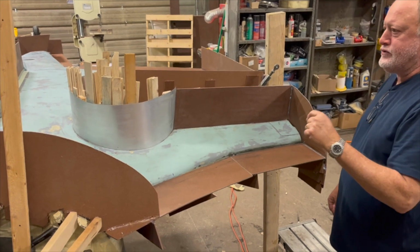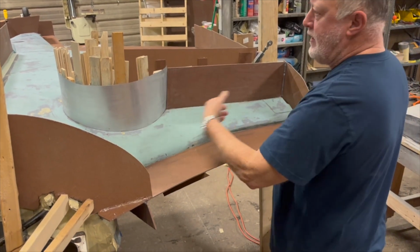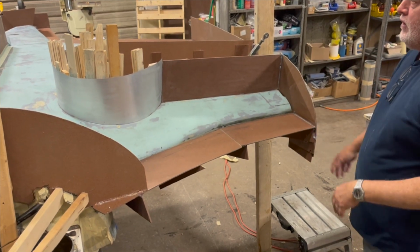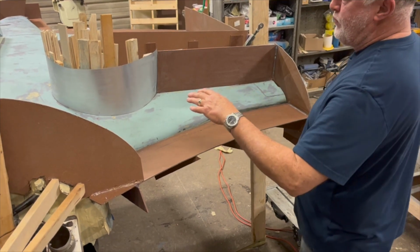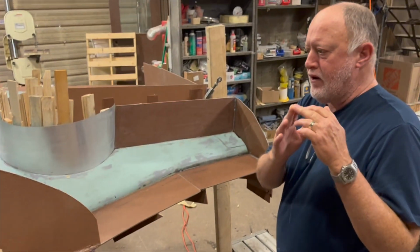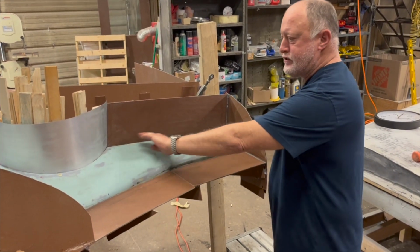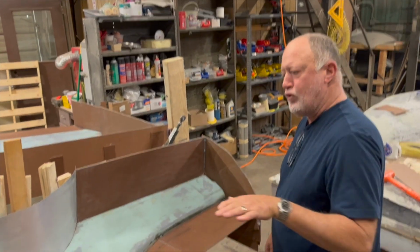Once that tooling gel is ready to have more on top of it, we'll come back and we'll brush all of our tight radiuses before we spray again. We'll spray another time with the tooling gel. Once that's done and ready to accept resin and glass, then we'll put roving in all the tight radiuses to minimize the possibility of air on those tight corners. And then once that's done, we'll come back over the top of that with a little aerosol resin putty combination, smooth that up, radius it a little bit, and then we'll begin the layups.